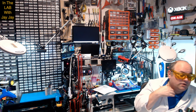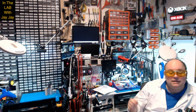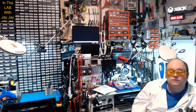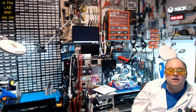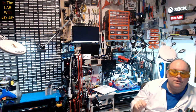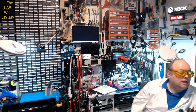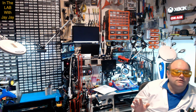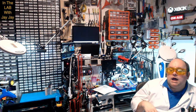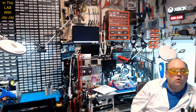I go through the whole process, I have various attempts. Then in the end, the connections were really quite flimsy. They weren't good enough. So what I did was I snipped off the banana plugs that I install in this video, and then I tinned the ends a little bit, and I used the screw terminals to attach them instead of banana plugs. So this video is just an interlude of me trying to figure out how to attach some banana plugs. If it's anything at all, it's a lesson in what not to do.